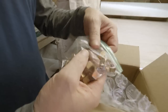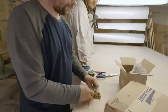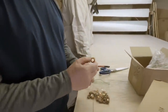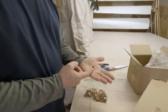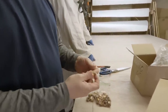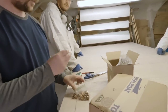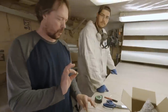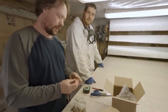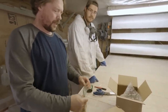651, I think, is the alloy. And it's silicon bronze. It's resistant to corrosion, salt water. If you just use copper, it just gets eaten right up. Brass, yellow brass does not fare very well. So this is what you want to use below the waterline or anywhere where you could have corrosion problems. Yeah, 651 is the alloy.